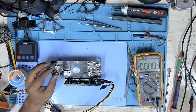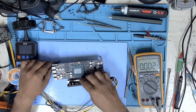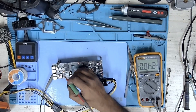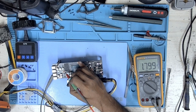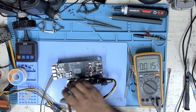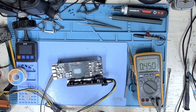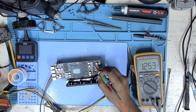After the card cooled, it was time to test if 1.8V was present. I connected my Tiffin box power supply and tested — and yes, we now have 1.8V. I then checked PEX and it was present too. Finally, I checked the core voltage and all voltages required on the GPU were present. This was good enough to boot.